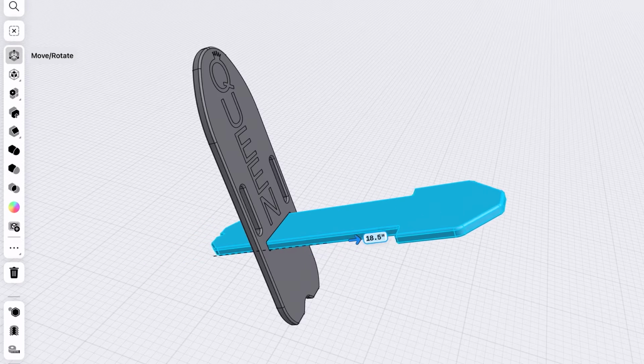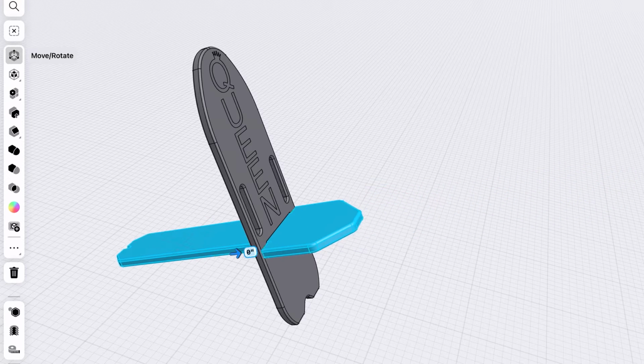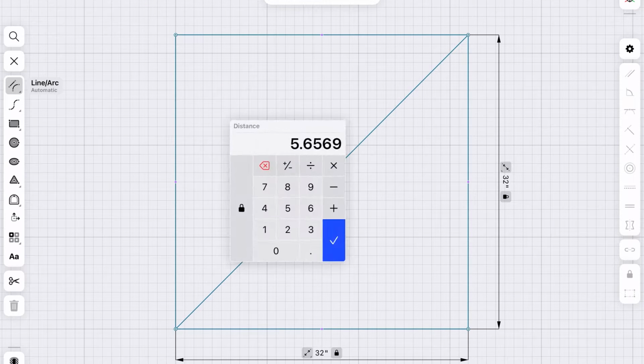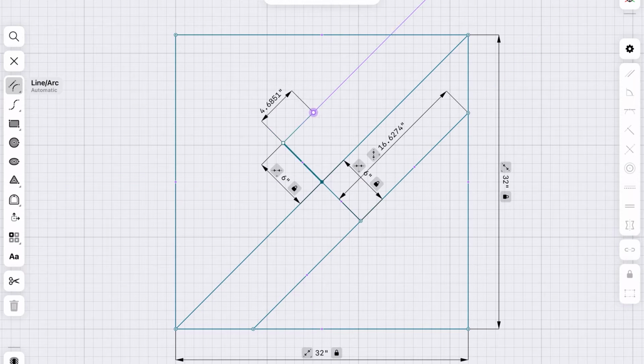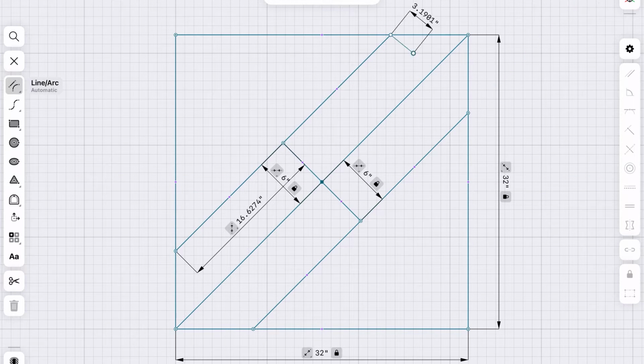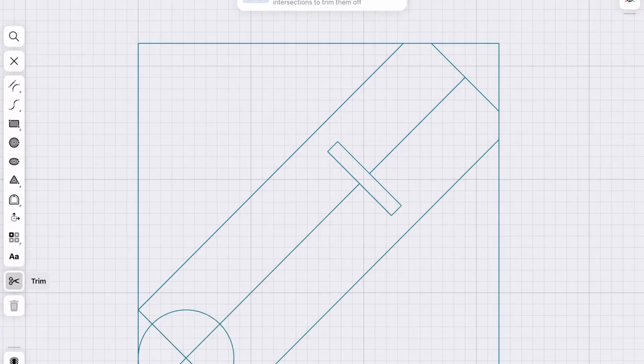The two parts of a Viking chair are the back/front leg and the seat/rear leg. The widest part of both parts of the chair are 12 inches, so I'm extending 6 inches out in both directions from that center line. And you'll see we start to go out of bounds closer to the corners, so I'm going to round off the top of the back. I think that looks nice anyway.